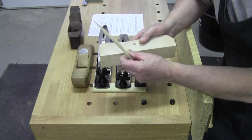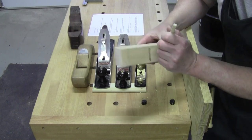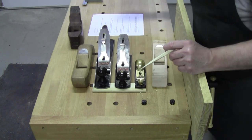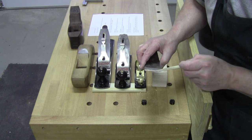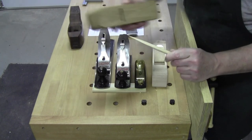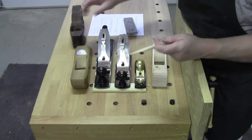Unless you want to know what this is — this is a stick with a point. It's for cleaning little pieces of wood that get in the way on your planes. If you set your plane mouth opening too tight, sometimes you get what's called a foul mouth. Or if your chip breaker is set so that there's air spaces underneath the front edge of it where shavings can get stuck, they'll just bunch up and they'll give you a foul mouth. So if you have a stick with a point, you can come in and pick out pieces of wood, shavings, whatever, without damaging your blade or the wood on your plane.